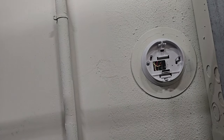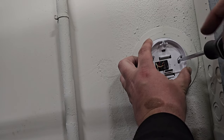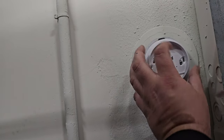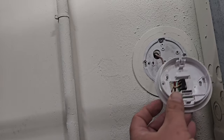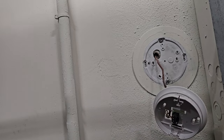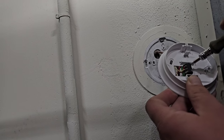Ideally you want to take a picture of the cables before removing them, in case yours aren't labeled or have non-standard colors. I'm going to save this old thermostat — you never know when it might come in handy. I have a tiny flathead screwdriver here. The wiring is red to R and white to W, so let's take those out.